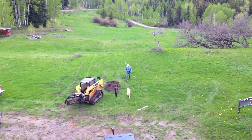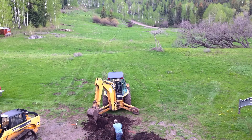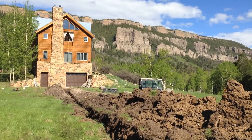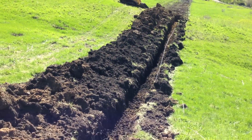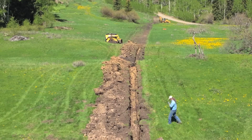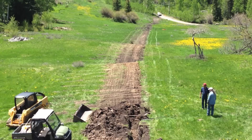Now that we knew where the phone line was, my contractor decided because of all the rocks on the ground it would probably go faster just to use the backhoe to dig along. We dug along and tried to find the phone line, which we never did, and it rained out the first day. We continued digging with the backhoe all the way down to the road - that's about 900 feet of trench from the house to the road. It's important when you lay a transmission wire into the ground that you protect and bed it properly. This is gauge 6 wire designed for direct burial, but it's important to bed the wire by hand and make sure it's covered and protected before you cover it with equipment.